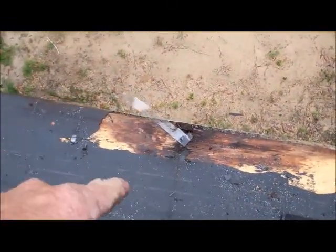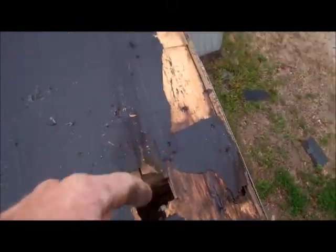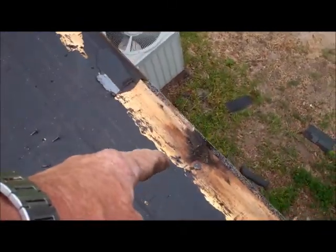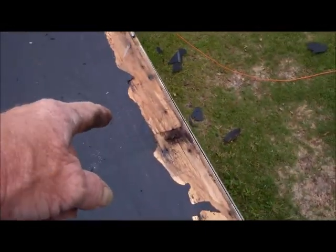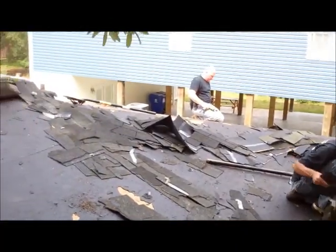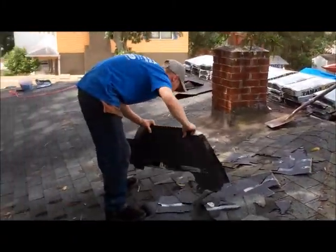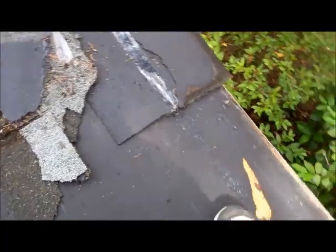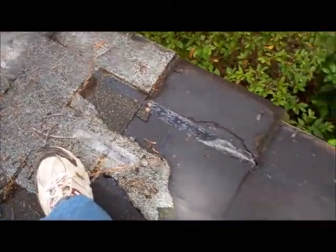When they ran these shingles, they ran the starter and the shingle on the same line — that's why you get rotted places like that every three feet. You got a rotten spot because the shingles and the starter run at the same place. They did the same thing again: they ran the starters upside down, broke them where they break, on these same runs. So of course you're gonna get rotten wood at the bottom every three feet.